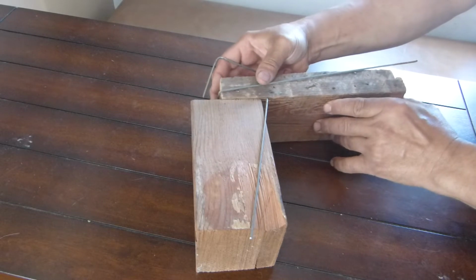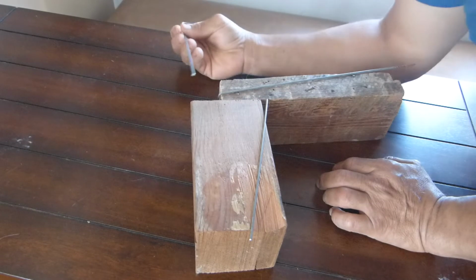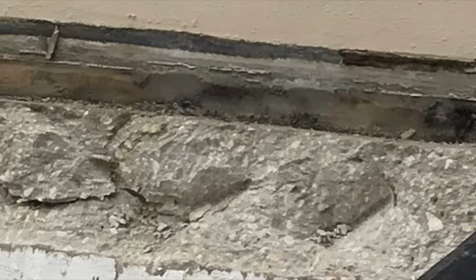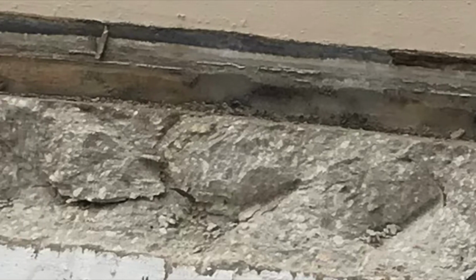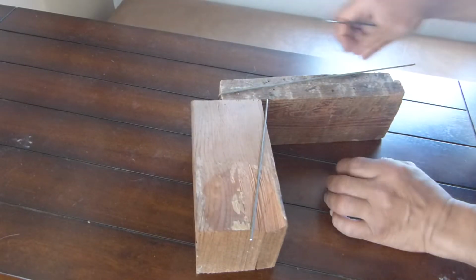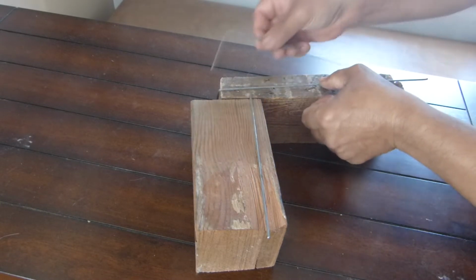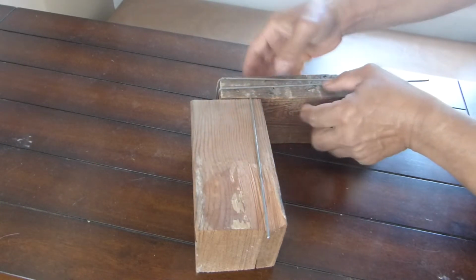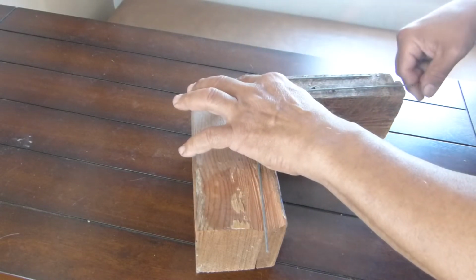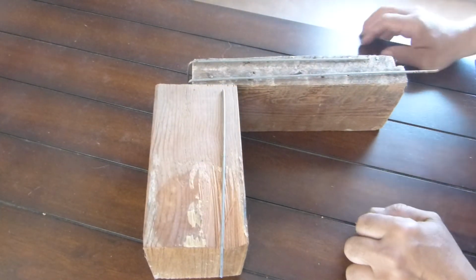But the reinforcement doesn't go all the way back there. It's not there. It's internal. How do I know that? What's left behind, the concrete that's left behind, the blowout, if you will, the remaining cone shape. Here's our rebar reinforcement, top steel and bottom steel, with a little bit of concrete cover. Again, this represents the deck.